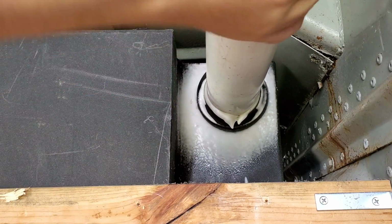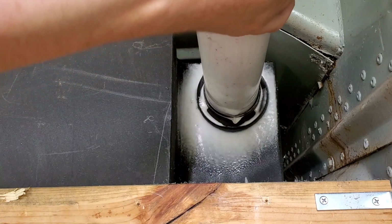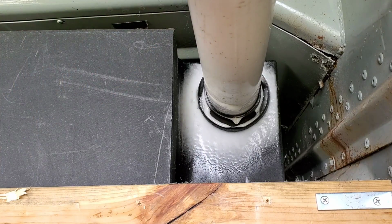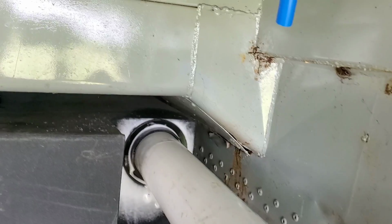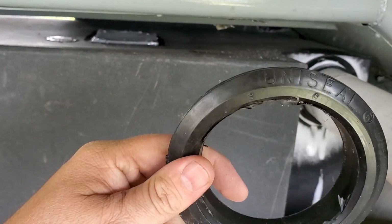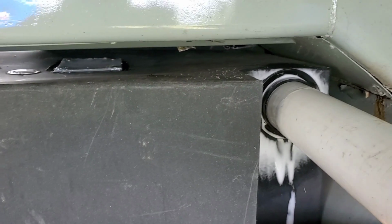Then push it in. And I'm kind of lining it up. There's your tank seal. Then that cleaner will just fall off of there. I just wanted to show how to use these Uni Seals. Like I say, they're pretty cool. And they're flared, so when you push it in, you're actually flaring in the inside lip, which hugs the tank.